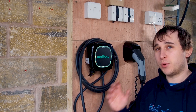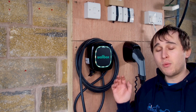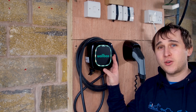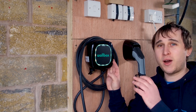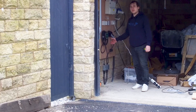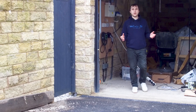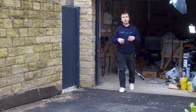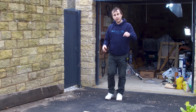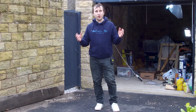One of my favourite parts about the Pulsar Plus is that the engineers ensured it will always fit your drive. They made it future-proof right down to the hardware — from the powerful Raspberry Pi to having pen fault detection built directly into the unit. This means your engineer won't have to buy additional earthing equipment, or drill into your driveway or dig up your garden to install earthing rods.